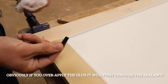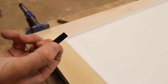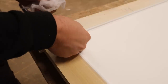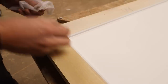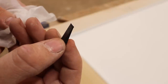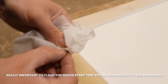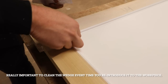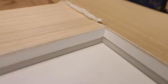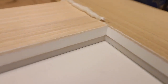Because this is painted, just a really simple clean off. I like these tiny little wedges — they're the best ones I've found, I'll put a link in the description. They've got a really nice tapered edge, perfect for going around curved mouldings, and they're dead cheap. Then just a builder's wipe, and you get an absolutely perfect corked internal joint that is basically completely ready for paint straight away — no cleaning up required at all.